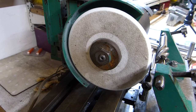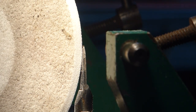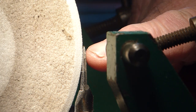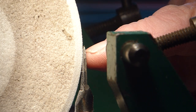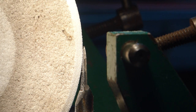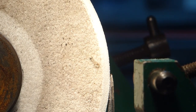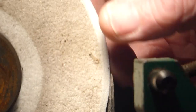This straight wheel has been beveled on both sides to give a narrower grinding edge. The tooth guide is positioned exactly on the centre line of the wheel and the centre line of the centres where the cutter is going to be ground — it's essential everything's lined up. I just grind my cutters by eye and they've always been okay, but this guide has got to be hardened at the tip without any tempering — it needs to be really glass hard. It has a tiny little radius on the top of the point to help guide the flute over the guide.